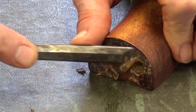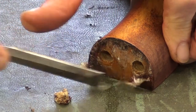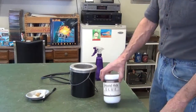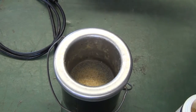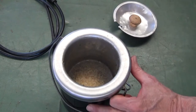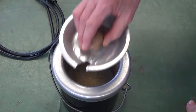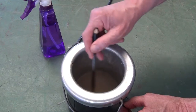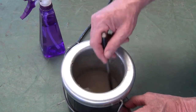I'll clean these joints while the glue is still somewhat softened. I need to get my glue pot ready — I'll shake in some hide glue flakes, add water, and wait for them to swell. I've let them sit about 30 minutes. I'll water it down just a little more and cook it. I've let this heat for about 15 minutes. Looks like I've got plenty of water in it but it's not overdone — a few flakes left to dissolve and this will be ready to work with.